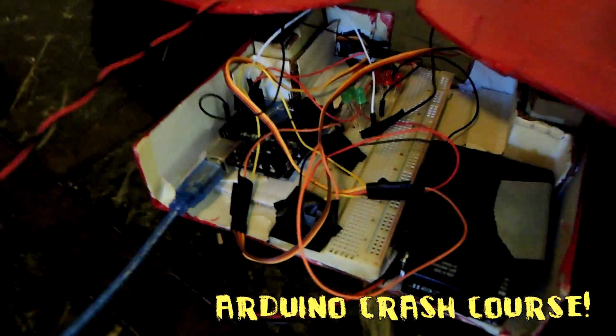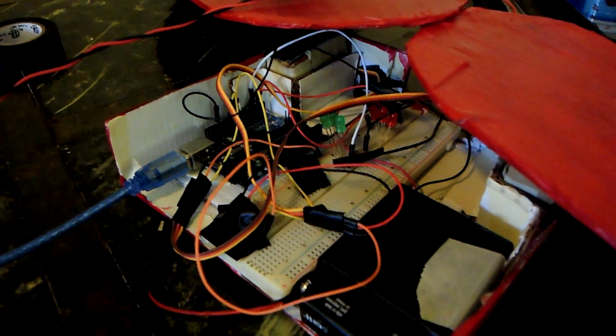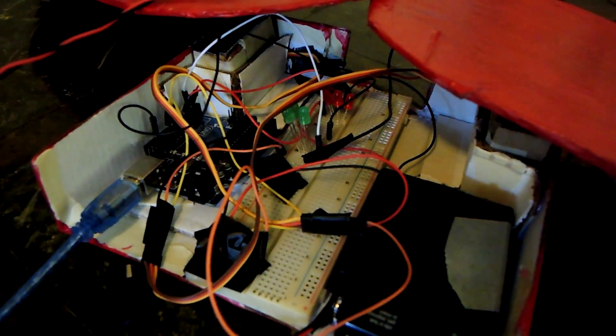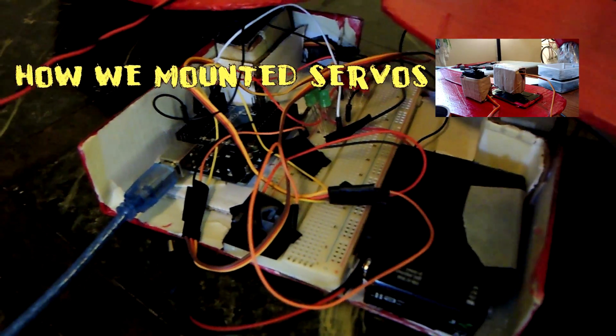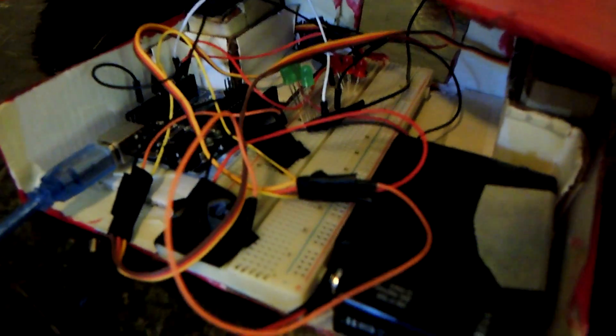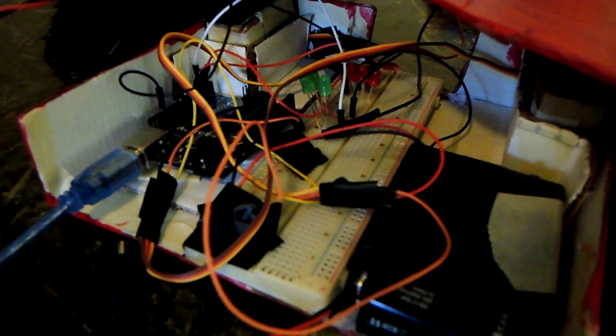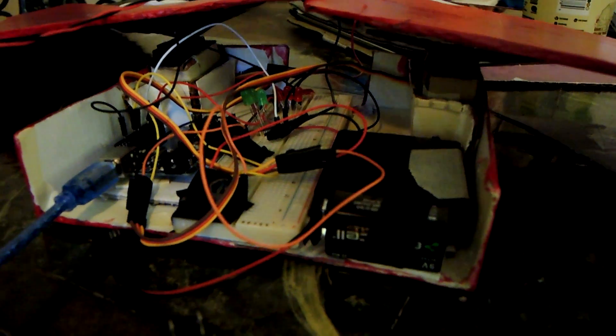Please excuse the mess and the dim lighting. This is the box for the wings with the NXT controller. The NXT controller worked pretty well, except the servos couldn't handle the weight — even cutting the wings back, they would still go back to zero because they just couldn't handle it. So we got some Metal Gear servos and decided to upgrade to an Arduino kit. I'm using the Uno with a breadboard. I've put some LEDs there for effect, and we're going to put red and green LEDs up on the wings as decoration. I've got a separate power supply for both the Arduino and the servos — running two 15-kilogram metal servos and they seem to be working and holding the weight.